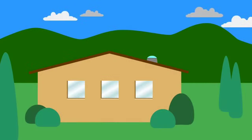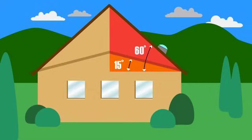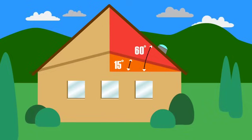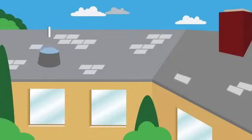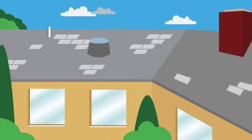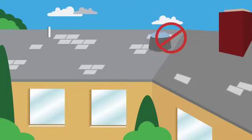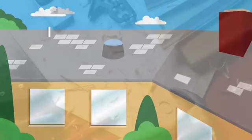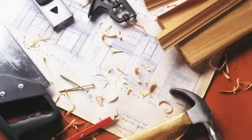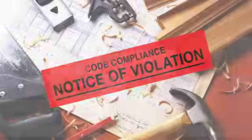Be sure that your roof pitch is between 15 and 60 degrees. Installing on higher or lower roof pitches can undermine product integrity and nullify the warranty. Be sure to check the roof deck for possible obstructions. Velux also recommends keeping skylights a minimum of 24 inches away from valleys and ridges, and be sure to follow local building codes when determining distances to vent stacks. Always remember to check with local building code officials for any possible code issues relating to your project.